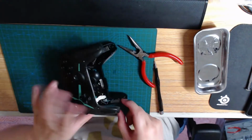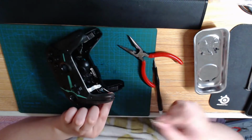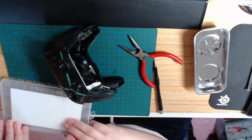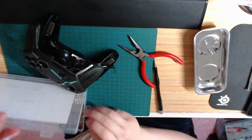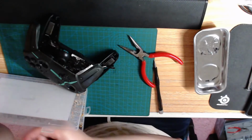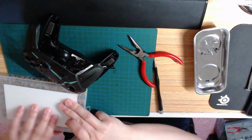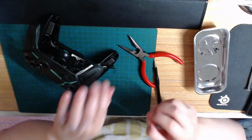It's working fine. And I'm going to lift the capacitor back out. There's that little capacitor. And we're going to switch to a higher strength one. So this one was a 0.68 microfarad, so I'm going to try 1 whole microfarad. And the number on the capacitor should say 105, which is correct. Now I can just seat this back in.